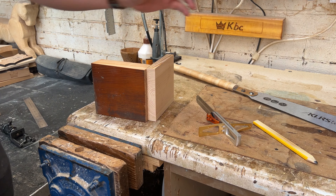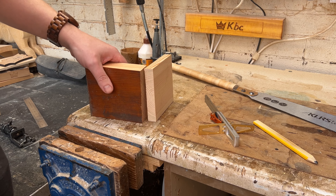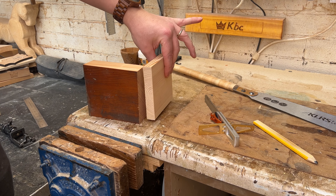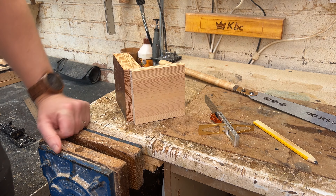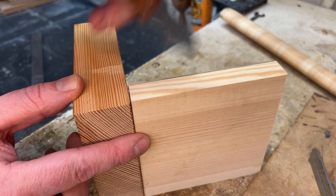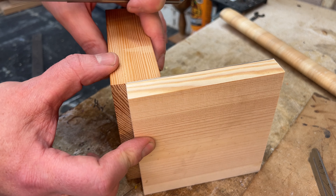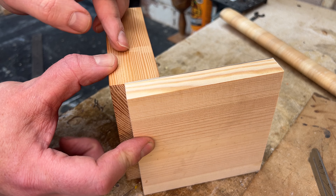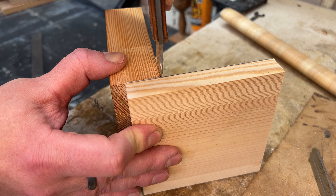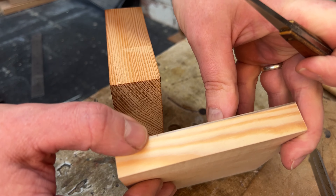So let's put this jig into action and create effectively a drawer front. I have a nice thick piece that's the front of my drawer and a nice strip of pine that's going to go down the side. Let's do a nice half dovetail to slot one into the other. First off we can just mark off the width of the side piece, then mark off however deep you want your dovetail to be. I don't want it to go all the way to the front because this is a drawer, so I'm going to mark off the depth of my tails.